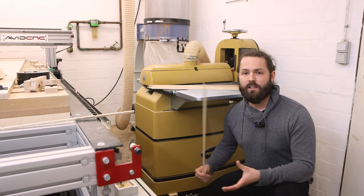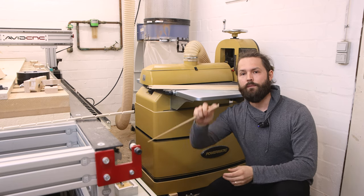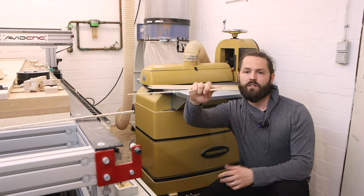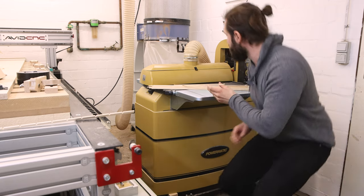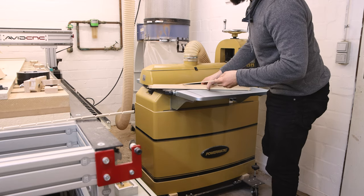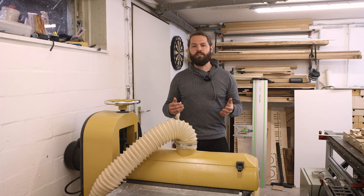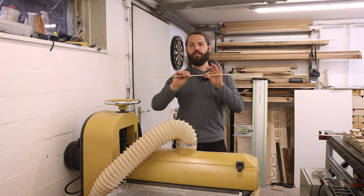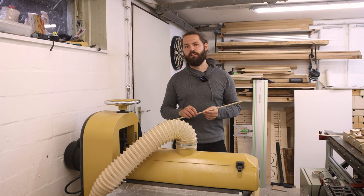Here at the drum sander I'm going to make two passes — one pass on each side of the strip. On the first pass I make sure to sand away the little nozzles at the end of the strips, which are caused by the deflector wedge at the table saw. I just put in the strip and lower the drum until it barely touches. The most important part of the first pass is that you don't sand your strips too thin. So after a test piece I check if it's still too thick to fit into the slot of the Kumiko grid.